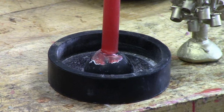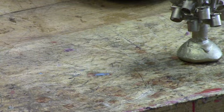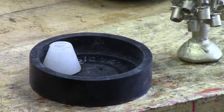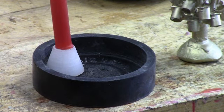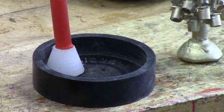So what I came up with is I take these rubber sprue bases, traditional like this, where the sprue is in the center, and I cut it out, get rid of it. And then on the lathe, I turned down a tapered sprue base. And now I can offset this from the center of the base, and I just barely attach it with some tacky wax and seal it with wax at the bottom, and put my sprue on the top of the white sprue base there. And now, in this configuration, it gives me a lot more capacity within a small size flask. So now I can go in and mount multiples away at a different angle, and I'm not restricted by the distance that I had to live with when the sprue was in the center. So just a little idea I came up with. I use it quite often.